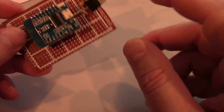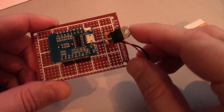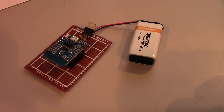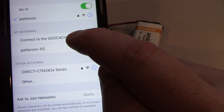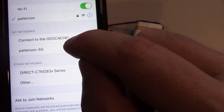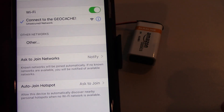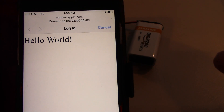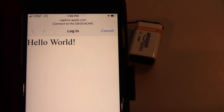I want to show you what the project looks like with the captive portal. This is the prototype board for the ESP8266 D1 Mini. Got a voltage regulator. What we're going to do is plug it in to the 9-volt battery and it turns on. Now I'm going to pull up my phone and show you what the user sees. What they see now is 'Connect to the Geocache' — that's the SSID I provided. Notice there's no password, there's no lock next to it, because we set the password to blank. If the user chooses it, they should be able to connect, and they're actually taken to an HTML page which you can change in the source code. That's how the captive portal portion of it works.